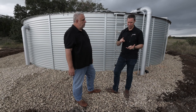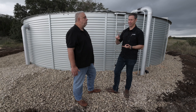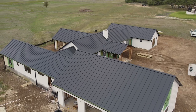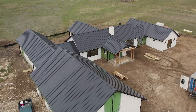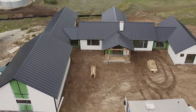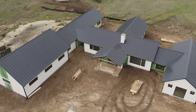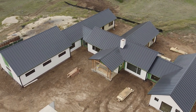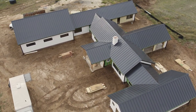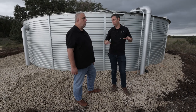And as a builder, the more valleys I see, the more dormers I see, sidewall flashing, kickouts. This roof, it's simple. You look at the drone shot, I'm straight above it. It doesn't look super complicated, and I don't see a single vent penetrating the roof because the builder has plenty of gable space to pop those all out. So that means that roof that should be a 75-year roof is legitimately going to go those 75 years without a leak, without a problem.